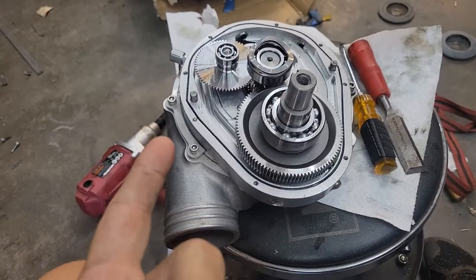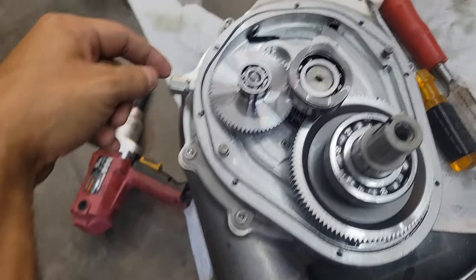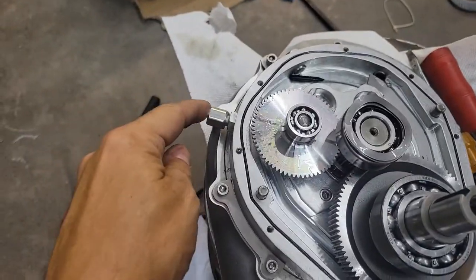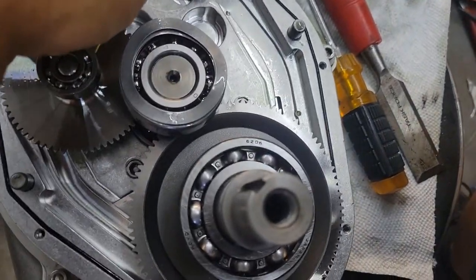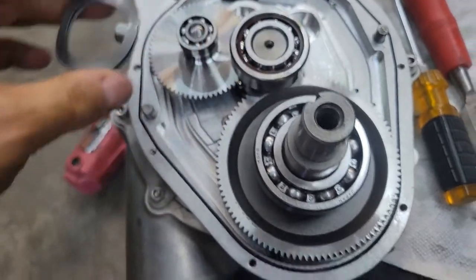This one's already in the two o'clock position, which is what he said he needed, so I'll leave it there. If you move it, you'll have a drain plug here that will need to be moved as well. This is your oil slinger - these just come out and move wherever you need them to go and slide back in. Your drain plug needs to correspond with whichever position you put it in. Don't lose your dipstick here - make sure that stays in behind this retaining plate so you can check your oil. You can see this is all nice and fresh, still has the factory oil in it.